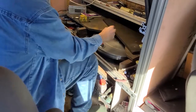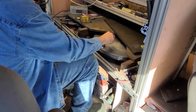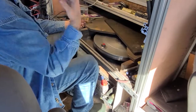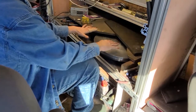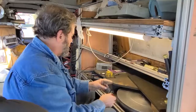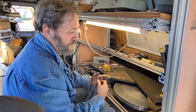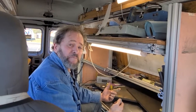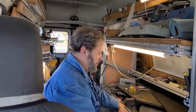Okay. If you look, I'm only a couple inches above my wheel. So ergonomically, I don't have any pressure on my shoulder, and it just allows me to do exactly the same thing. It's the little items like that that make your grinds come out the same way every time. Yeah. You know, we've got to be consistent. If not, we're wasting our time.